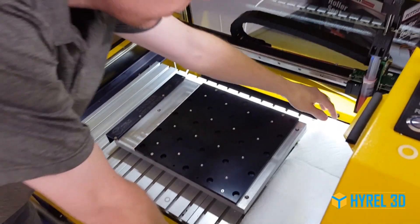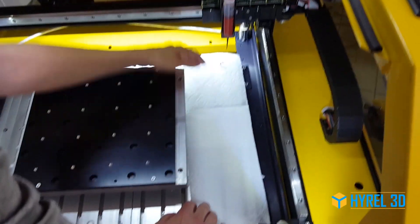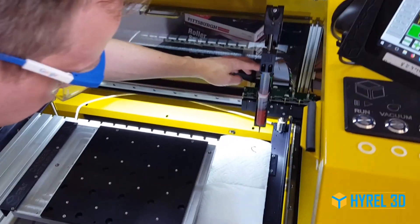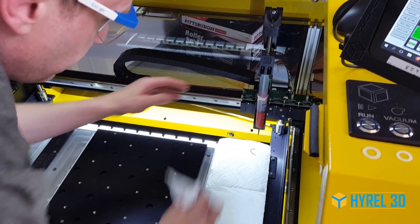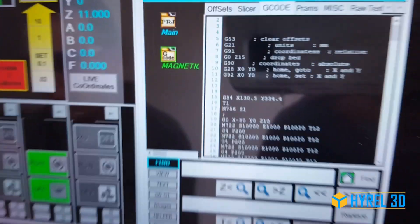Because we're working with silicone, which is going to drip after we print, I put some paper towels here to protect the surface. I'll go ahead and clear the tip of the nozzle, make sure we're flowing. I've built into the g-code a prime command before we start printing to make sure the nozzle is purged of air.